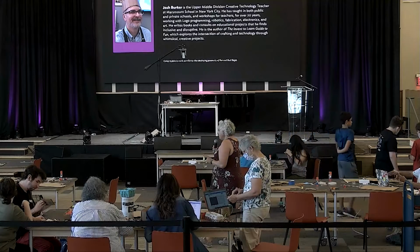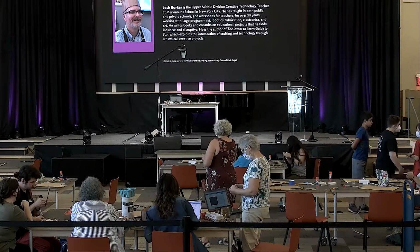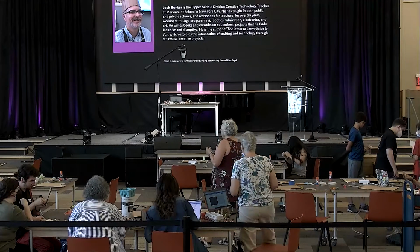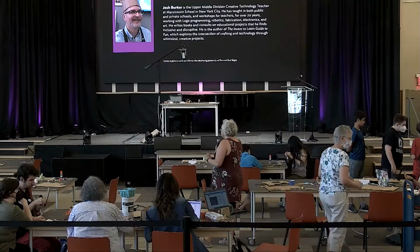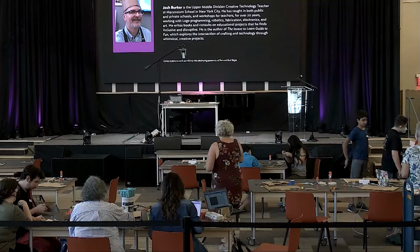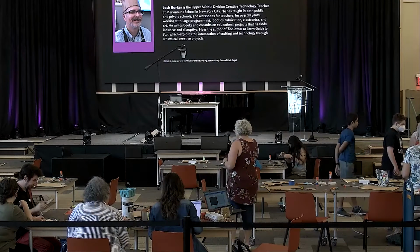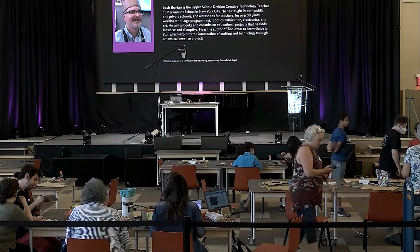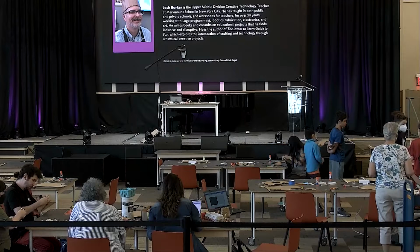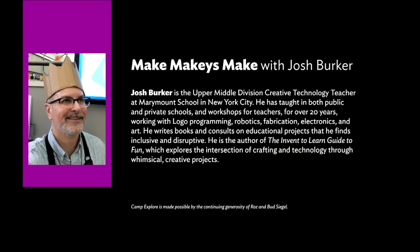And remember, anybody that was here for our paper circuitry with Balam, press the copper tape or the aluminum foil close to whatever wire connection you have. Make sure that is a secure connection. It will make your life easier in the end. Get one piece working, and make sure when you connect it with the Makey Makey, it works, and then you could add more.